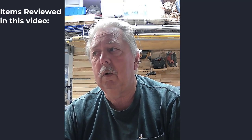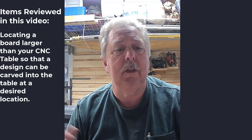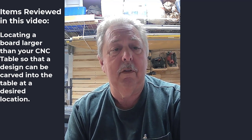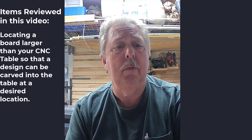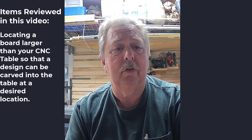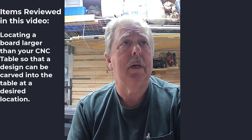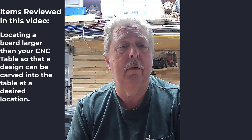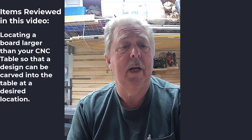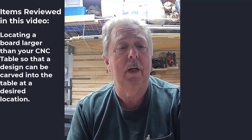Let's do a review real quickly of the things that we learned in this video. The first thing we learned was how to locate that 7 foot, 15 inch wide table on a 3 foot CNC. Basically we didn't have to use a tile feature because all we had to do was move the table. I put a little stand to help support it at the right location because the cribbage board was only about 28 inches long or so. I was able to locate it so that the area where I was going to carve the cribbage board was centered to the CNC bed. And my bed is 2 feet by 3 feet, so it fit right in that area.